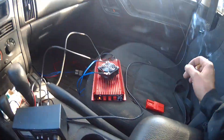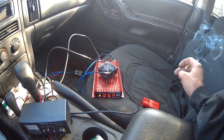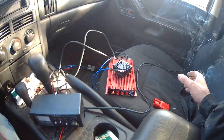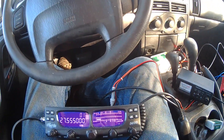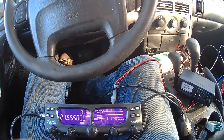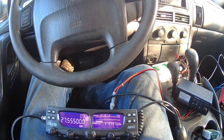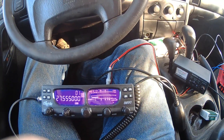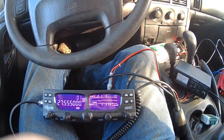If you're running your amplifier with the motor not running, that battery is going to drop to 12 volts pretty quickly. But when you have the motor running you're probably going to be doing at least 13.8 volts, maybe 14.2 depending on your vehicle. Just going from 12 volts to 13.8 volts is 1.8 volts more, and that's a big percentage — 1.8 is 15 percent of 12 volts.